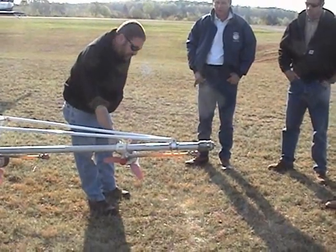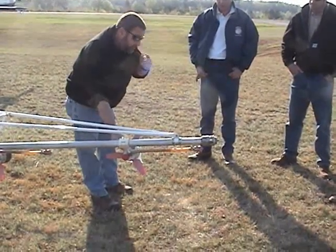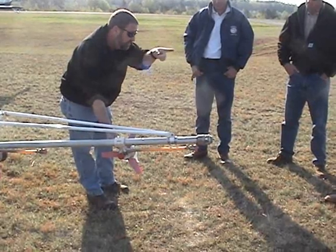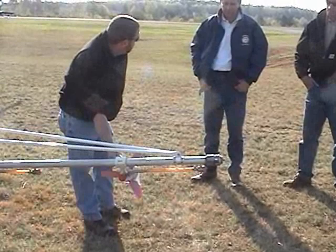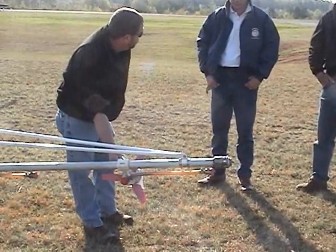Yeah, 15 seconds. It's going to run for 15 seconds, and then what you're going to need to do is take your bag and go outside and measure what comes out of each bucket individually to check the flow rate for each nozzle.